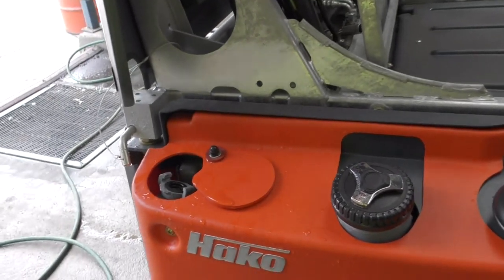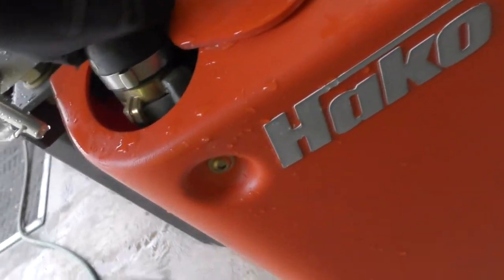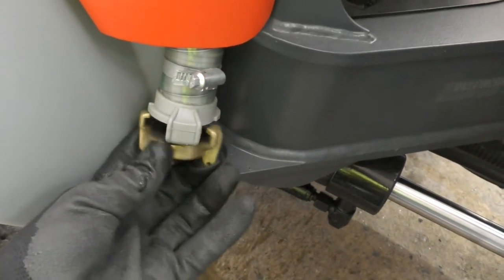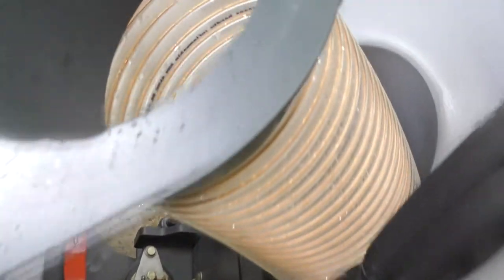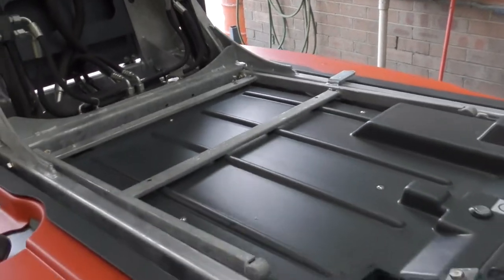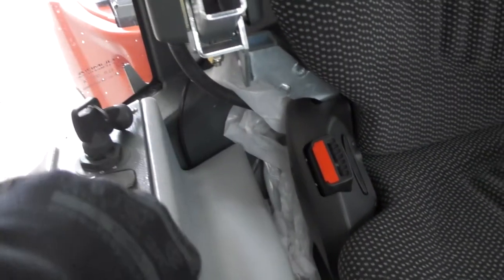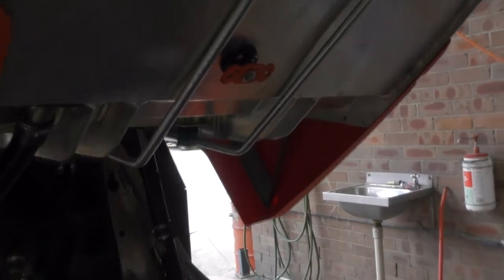When you're done, just reconnect this hose and replace the bottom fitting. Close this valve since you're finished sweeping. While you're here, look down to make sure there's nothing blocking your hose and rinse that hose out as well. Now we're done with the major clean-out at the rear — just going to lower the safety bracket, start the machine, and lower the hopper, stopping halfway to lock the belly plate, then reattach the latches at the back.